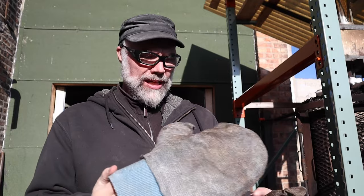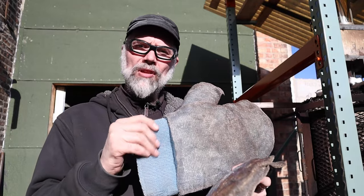The other thing, which is what I prefer to use, are these heavy mitts, more than just oven mitts, but actually kiln mitts. It's a lot of times a heavy Kevlar material, and they have different layerings. This one actually has a stainless steel mesh on it, and that creates an extra vapor barrier, and also holds up to the abrasiveness of the ceramic shell. If you just use standard Kevlar mitts to pull out your shells when they're that hot, it'll break down your gloves pretty quickly, after a dozen or two uses. So the stainless cloth winds up holding up pretty well.